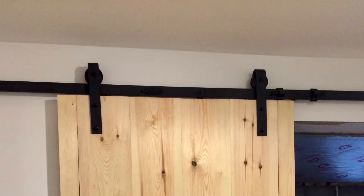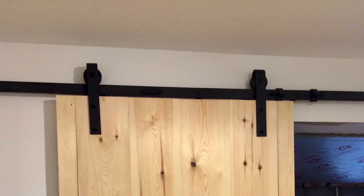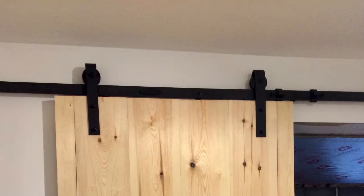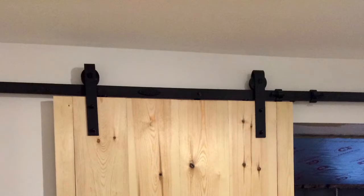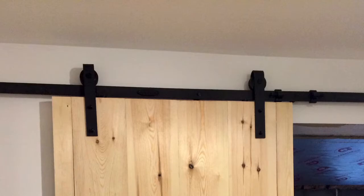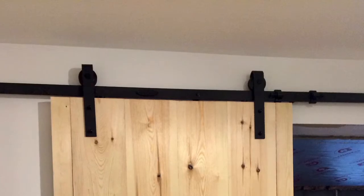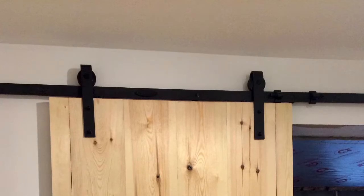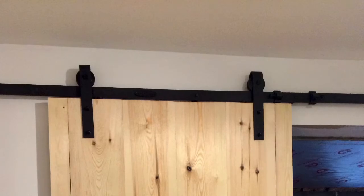The rail I purchased came with instructions for the position and fitting of the top roller runner sets, so that was quite simple. While the door was on the floor, I put the rollers into position, screwed or bolted those loosely, and got them ready so that when it came to hanging the door I could put it up quite simply and make any adjustments in position.